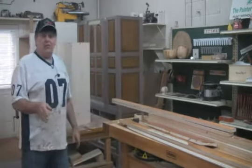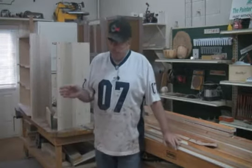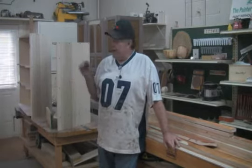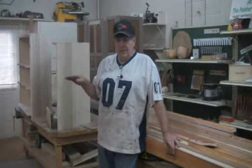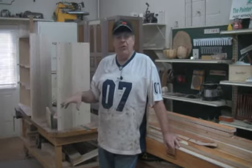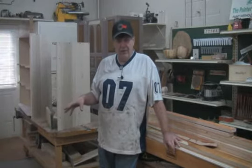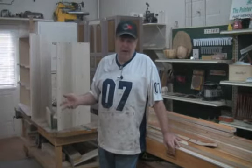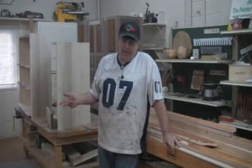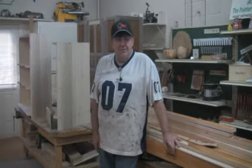That's the way you deal with wood. Don't go out and buy a bunch of wood, come home, slam it through a planer, and start building. Give it a chance to acclimate. Give that loaf of bread a chance to dry out thoroughly all the way through. Then you have a stable thing. Might not be good eating for the bread, but it's good for the wood.